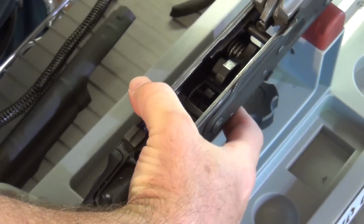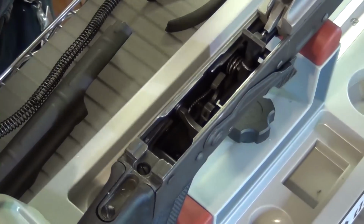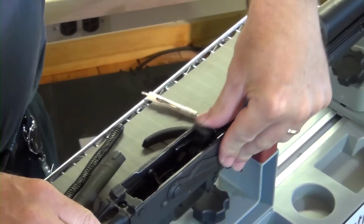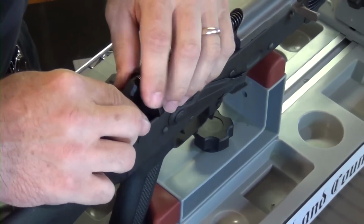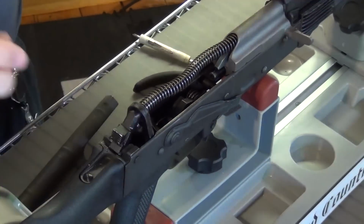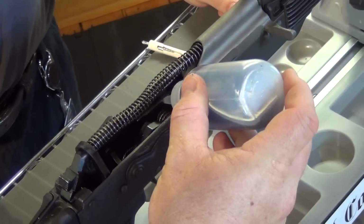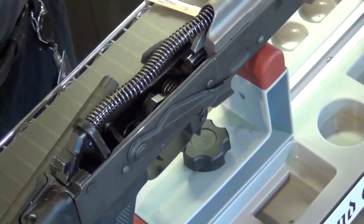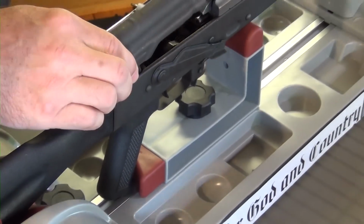Cock the hammer, safety does not go off. Good. And what you do is you check your reset. You want to put the spring in first, otherwise it can jump up. Take some lubricant and lube the spots that are noted here on the instructions, especially your sear. A trigger likes to run wet in order to get the best feel out of it. And let's take that off.